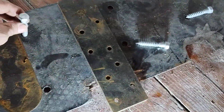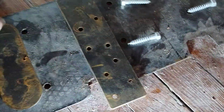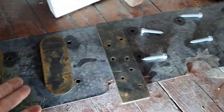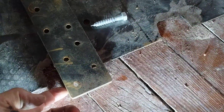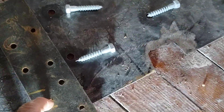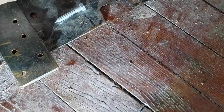You can see this will be plenty for my washer effect, my strap. The gusset plate effect is what it's making on this side, and on the other side the clamp force is what I'm getting. The screws in the middle are just redundancy to help keep it from spreading apart and fracturing. This is what I prefer - a little redundancy. Go with this, even laser cut. You can make your own, get straps and chop them with a bandsaw. You can go to your fabricator and say give me a piece of 316 steel and cut it up like this - pattern it with your cardboard.